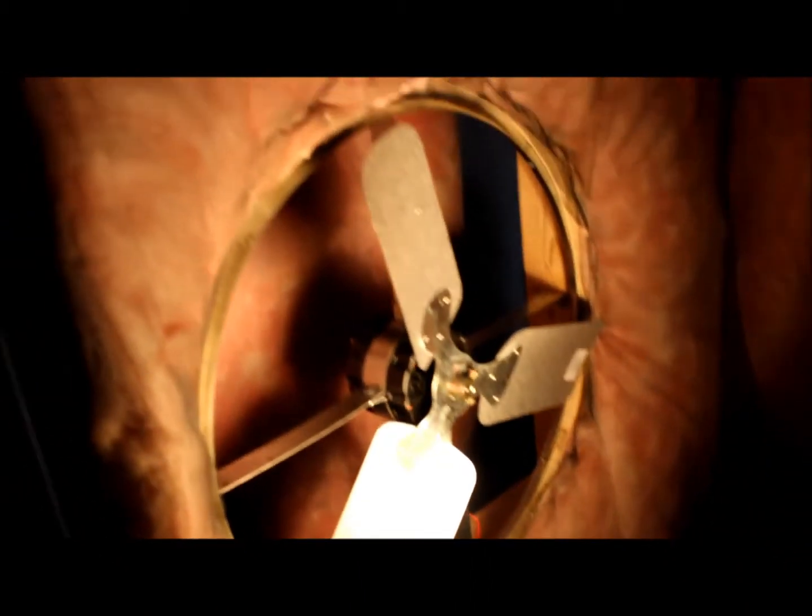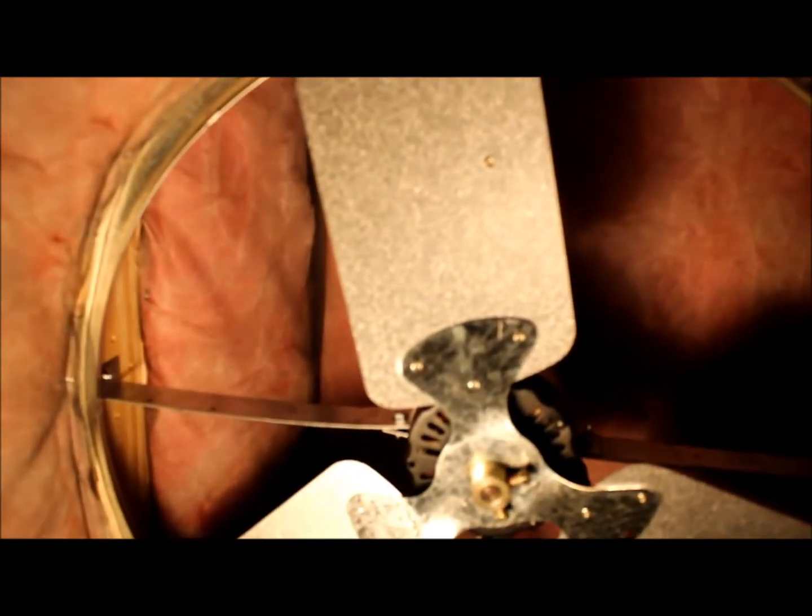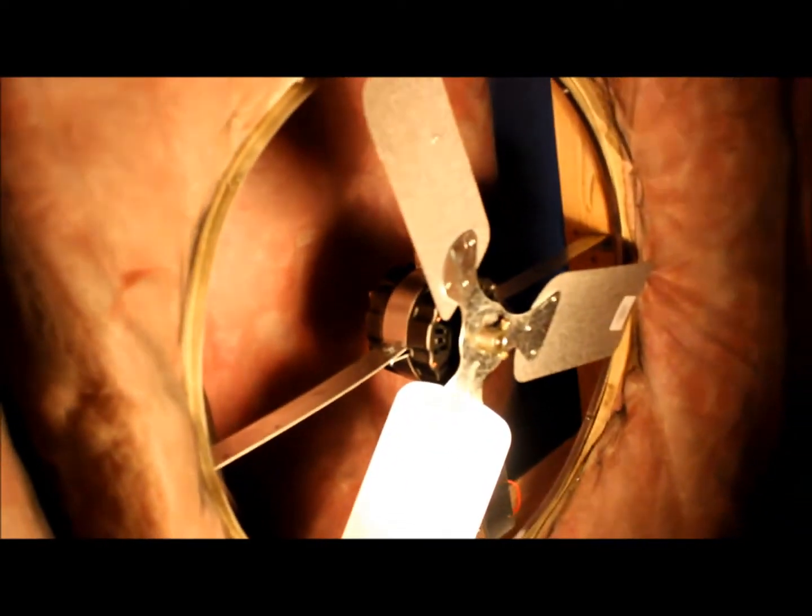I built a plenum inlet box to cover the fan. There's the fan, and it has insulation, and then there's more insulation here — so hopefully the sound comes through, gets absorbed by this insulation, and whatever bounces off gets absorbed by the other insulation. I think I'm going to need to put something on this back wall, and I'll need to cut some kind of intake on the side of the shed to let air in — otherwise I'm going to leave the door open. It gets pretty quiet in here with the door shut.